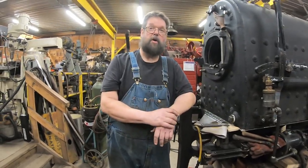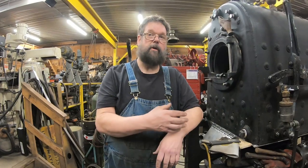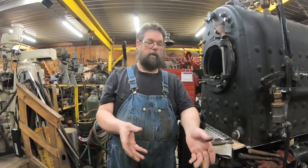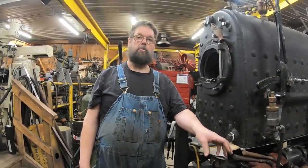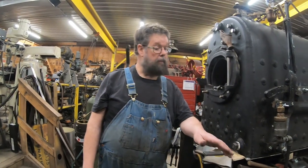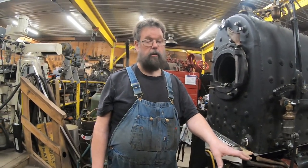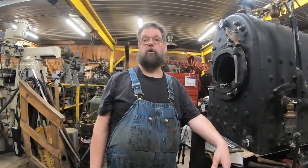These things are phenomenal. Now that I've got them here, I'm seeing that other engines — like some traction engines — also had rocking grates, because rocking grates were primarily used when you burned coal. You can rock all the clinkers and stuff off the grates into the ash pan and keep on going. This size of grate seems to be a common size used even in traction engines, so my pattern could possibly get used in something else. I would consider making a set of grates for a traction engine, because quite often when you get a traction engine, the grates are all burnt out of it anyway.